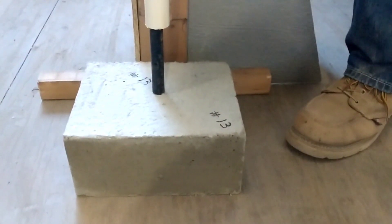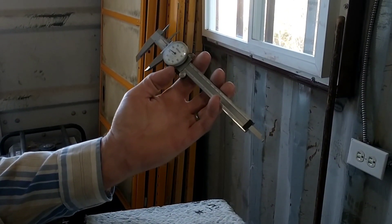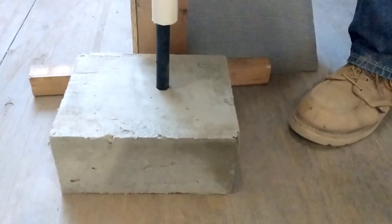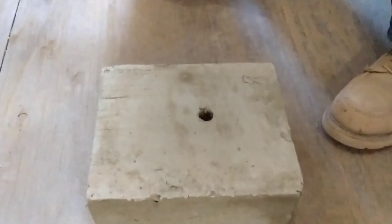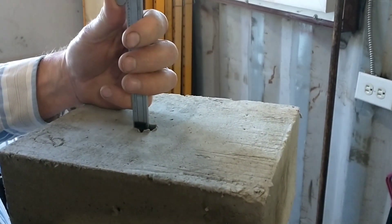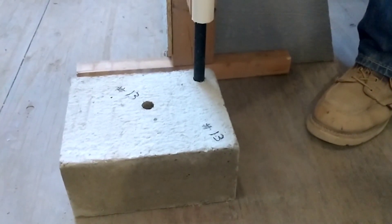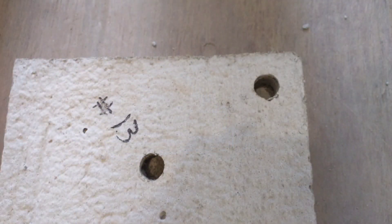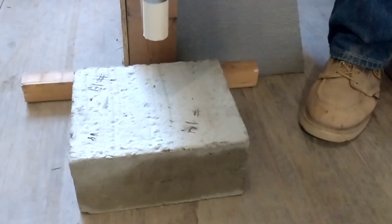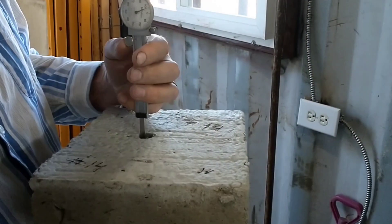Now we move on to our cellulose fiber mix. The first one had one and a half pounds of cellulose fiber added to our standard aircrete mix and it turned out really strange — soft, and it didn't seem to set up well. Our fingers would indent it, whereas they wouldn't with the other blocks. On the drop test it went in much deeper: 0.97 inches or 24.6 millimeters on the front, and 1.27 inches or 32.3 millimeters on the back, and even deeper on the corner. It performed very poorly in the impact test, which was kind of expected just from handling the blocks — they're noticeably softer.